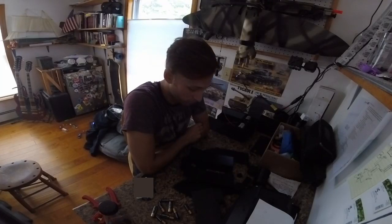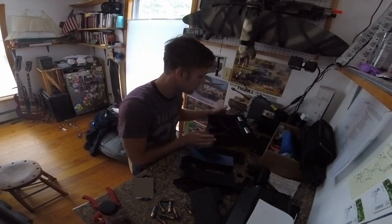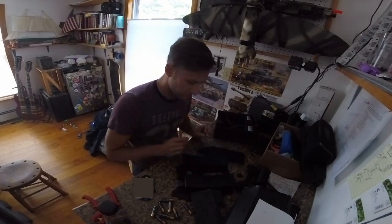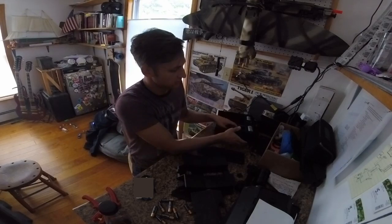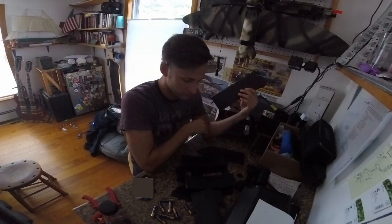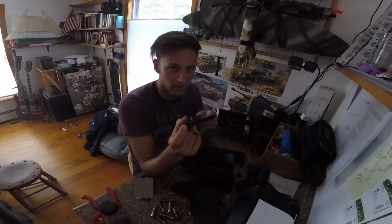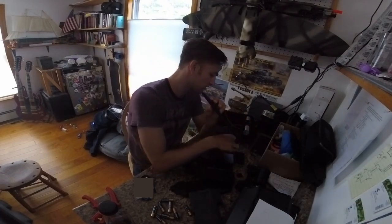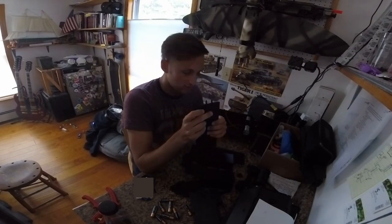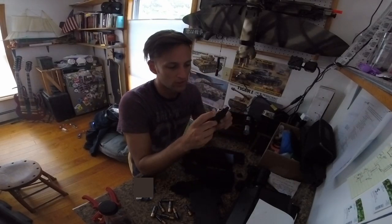We're going to be assembling some more parts that I printed off and just bring them up to what we had last time, which was the back drive area. As I mentioned in a previous video, the larger plates, like this, that are going to be full size pretty soon, have 3 areas for pins inside them. So we're just going to install those right now using 3/16 inch nylon rod cut to like 1 inch lengths.